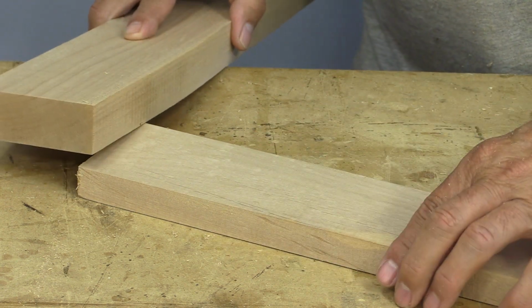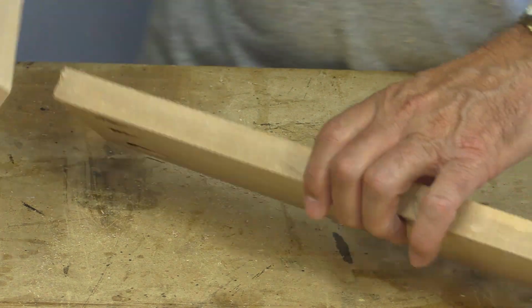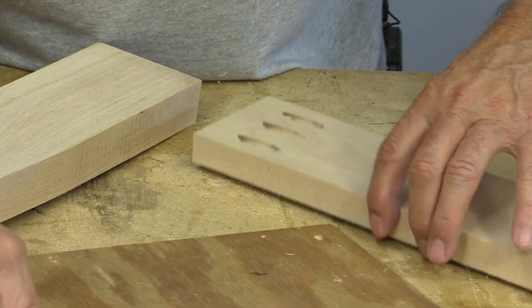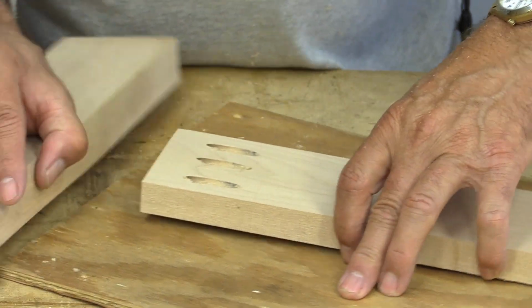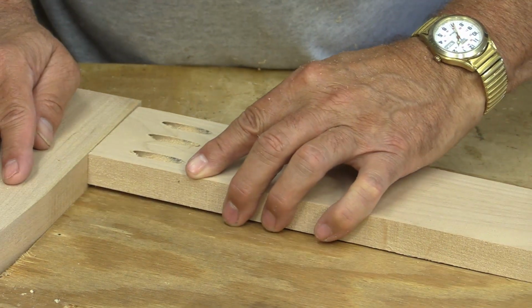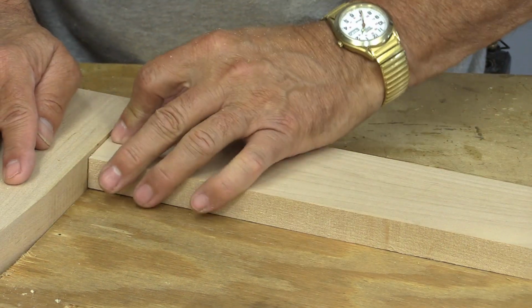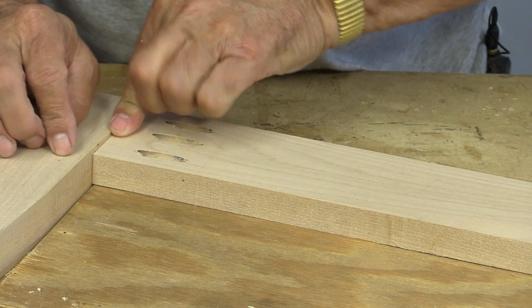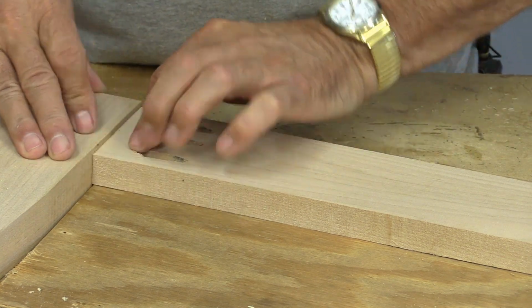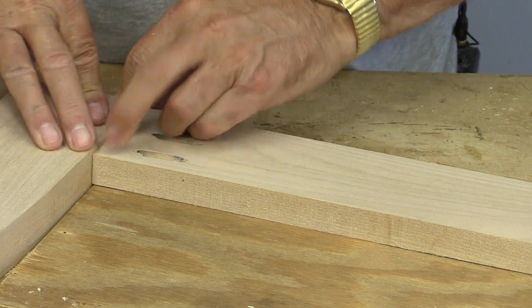And the easiest way to do that when you're using pocket hole technology is to just find something like a piece of plywood, just like that. You can lay that underneath, put your leg up to it, and now this cross member piece is actually lifted above, and when we get finished putting the screws in here, you'll see that we have a reveal in here.